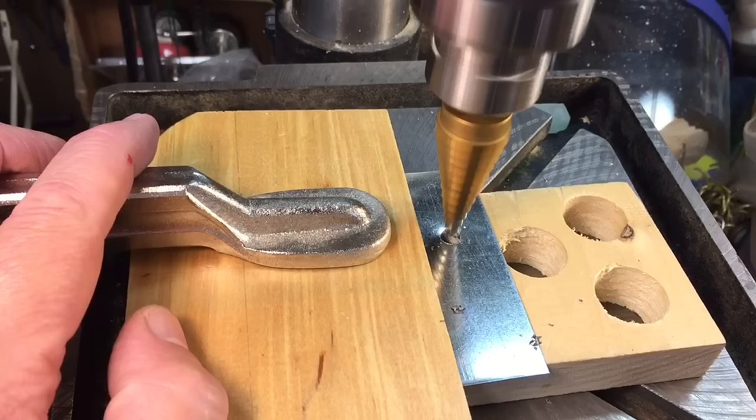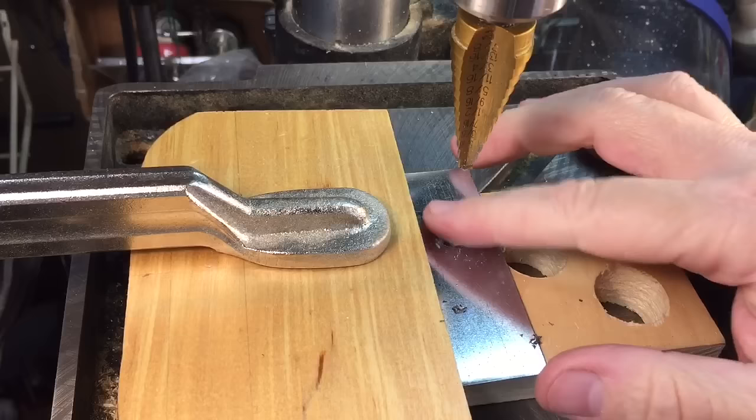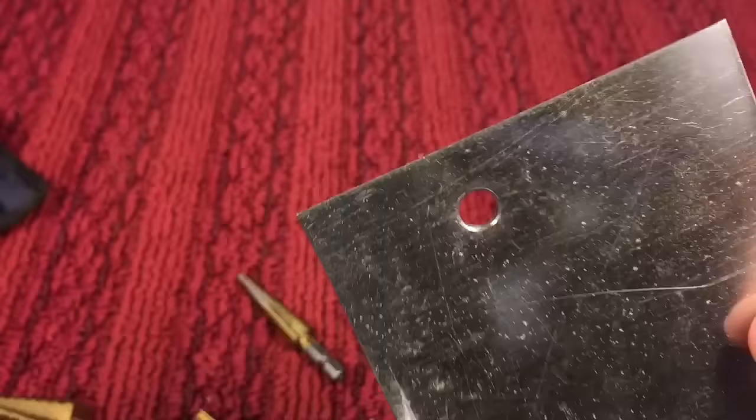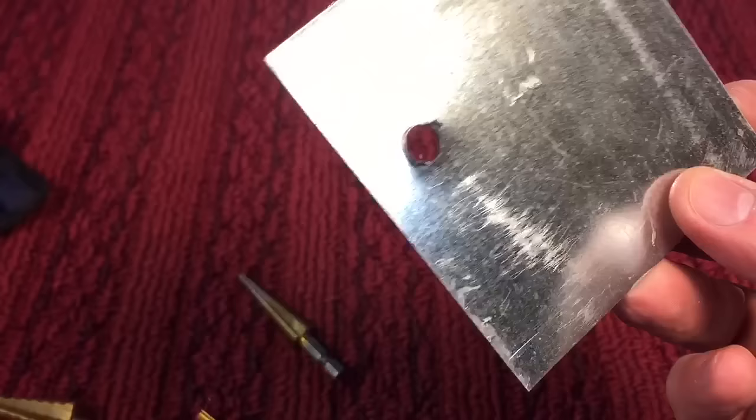There's the next step — drilling through. That's the next step. We'll do one more. And right there, that's the next step. You can see each step comes up and makes a nice hole — a beautiful, smooth hole. The hole I made was a 5/16ths hole, and you can see it's nice and clean. However, on the other side, whenever you're drilling sheet metal, you get a lot of deformation. You get a little bit of tear out.